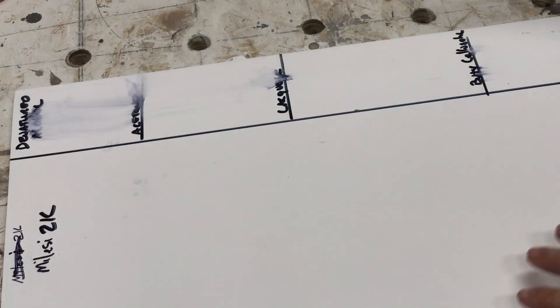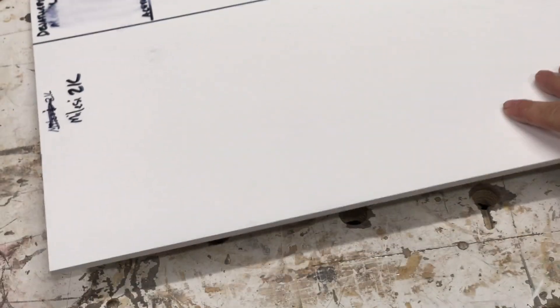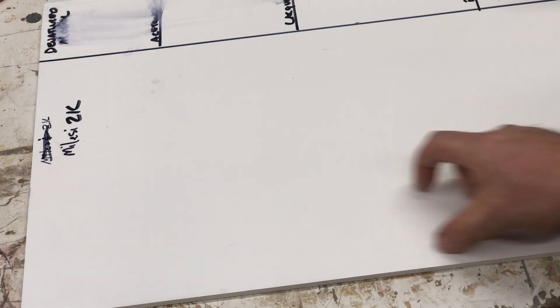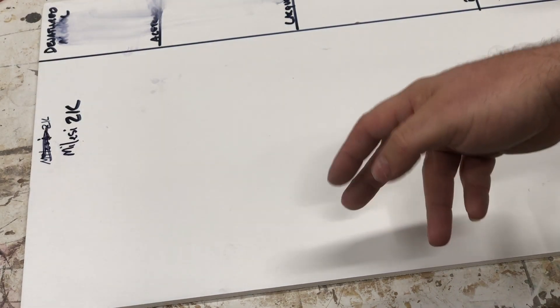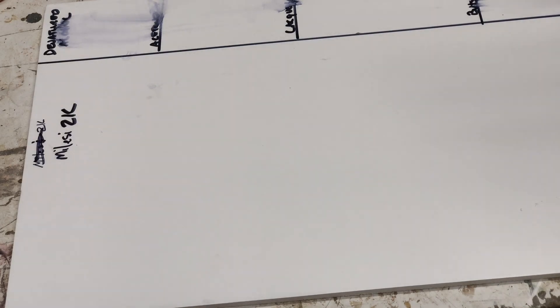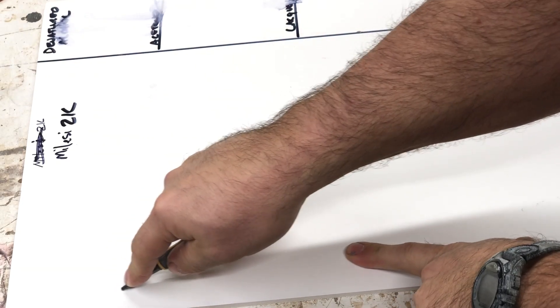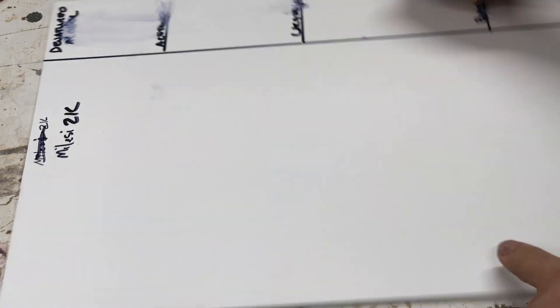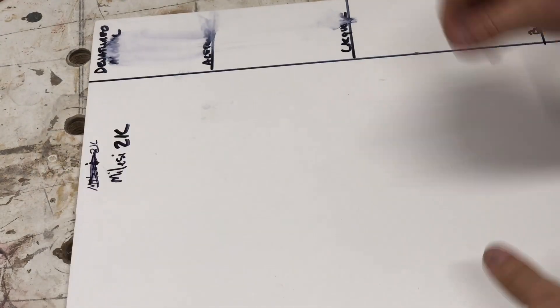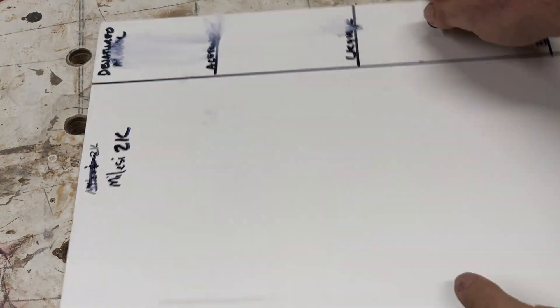Mar resistance. Now this is really sort of a — guys have asked me about this and asked me to do this — but I just want to say that this is kind of a difficult test to do because most of these products show very similar results in that aspect. The right way to do it is a true hardness test where it's a little thing with a cart and different size leads or thicknesses and they measure hardness that way. It's really kind of hard to measure, but let's do it anyway. Like a nail punch set — pretty much we're just denting the wood. There's not a lot of chipping, even though this is a pretty hard finish, so it's got some good flexibility. And then a quarter and penny test — same thing there, you're just getting a wood dent.